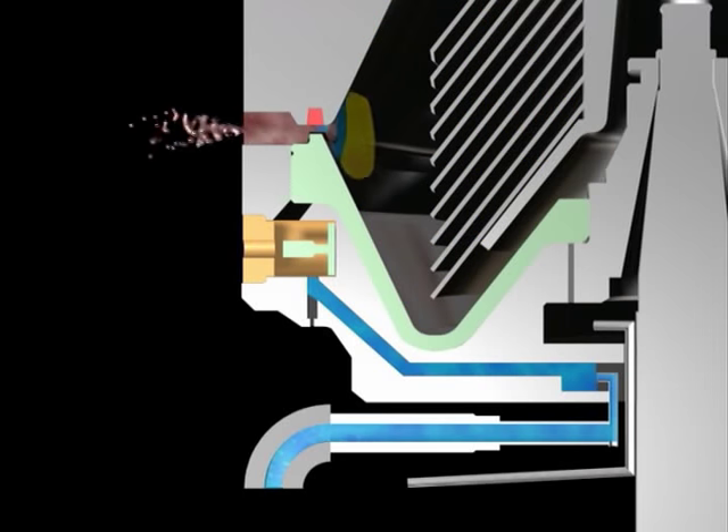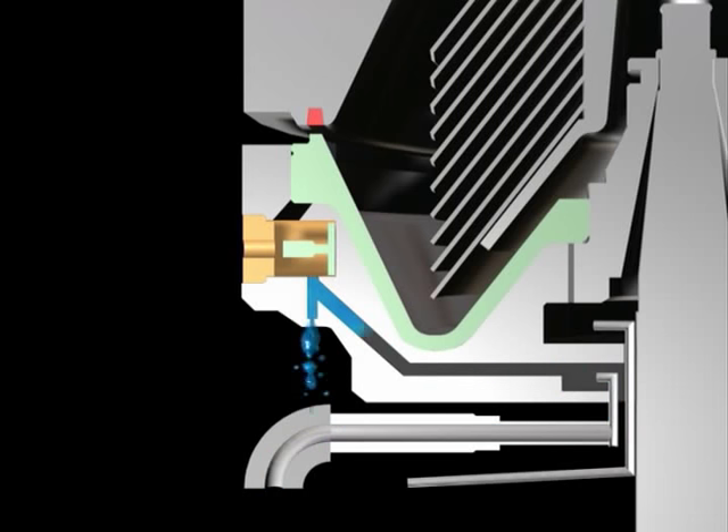When the operating water in the valve opening chamber is discharged, the hydraulic pressure inside the separation chamber causes the valve cylinder to slide downward. The dropping of the valve cylinder causes the sludge discharge outlet to open, and all sludge and liquids are immediately discharged from the separation chamber. When discharge ends, the supply of valve opening water stops.